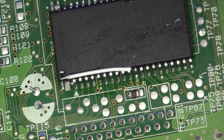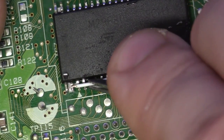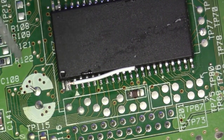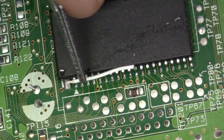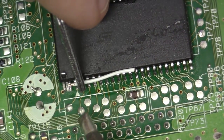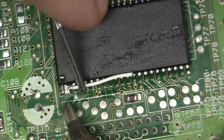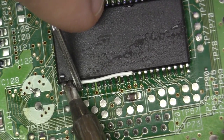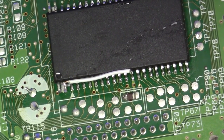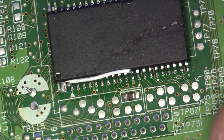I'm going to bring this in. I'm going to take my tweezers and position this just like so, into there like that. I'm going to come in here with one hand. I'm going to hold the wire in approximate position. With the other hand, I'm just going to tack. I'm going to tack this in. So, 1, 2, and 3. That's it. That's all there is. We'll flip around and we'll do pretty much the same thing to a different set of pins on the other side.